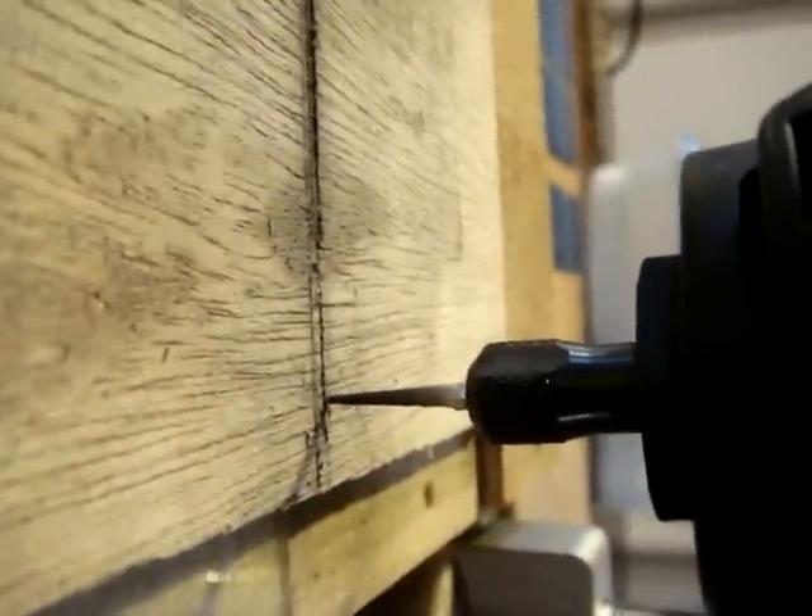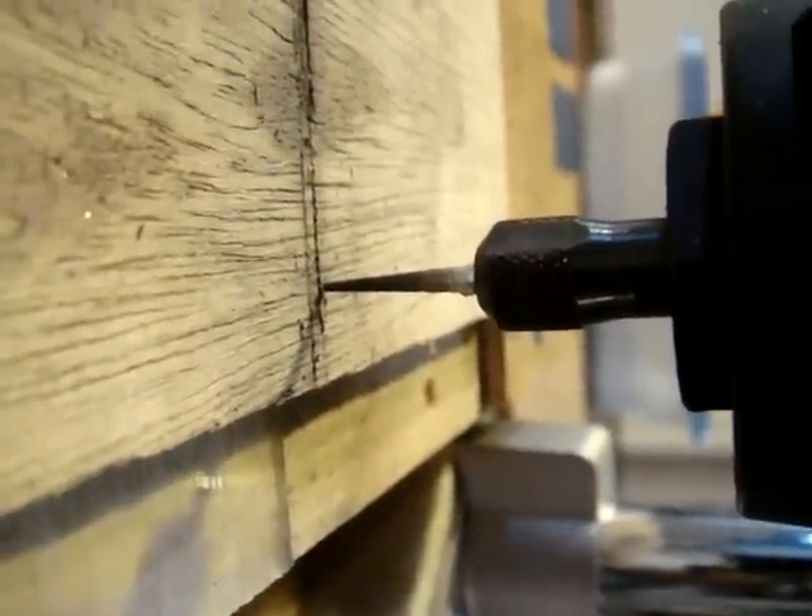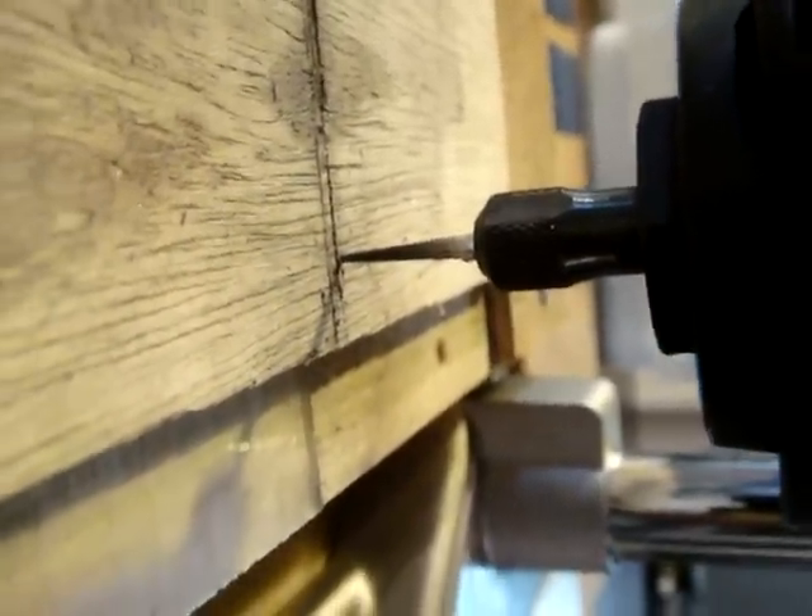Another thing to note is I'm using a diamond grinding bit for cutting these cells. You can use cheaper variety bits, but here's something kind of interesting: with the cheaper drill bit, after you cut a few cells, there will be almost a perfect groove where the solar cells have been sliding past the bit. So it wears out the cheap bits relatively quickly.